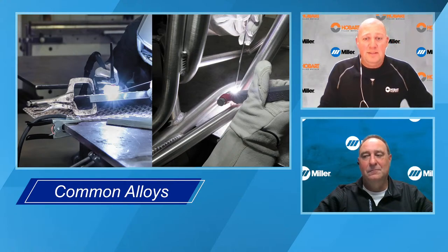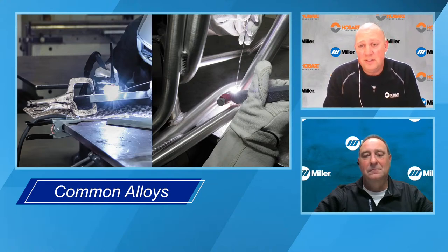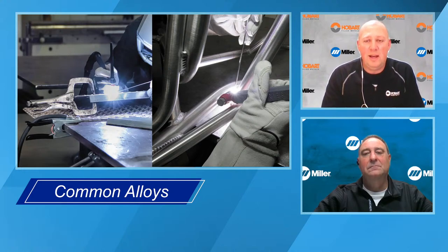Sometimes when you've got guys doing repair work on, like, a dump truck, a lot of times those are made out of 6061 or base materials that can be welded with either 4043 or 5356. So if you're going to repair a weld, you want to repair the weld with the same alloy that it was manufactured with. If you don't know what it's manufactured out of, you can call us. I'm familiar with a lot of the different manufacturers, so I can kind of help you figure out what alloy it is. Or sometimes this trick works, sometimes it doesn't.